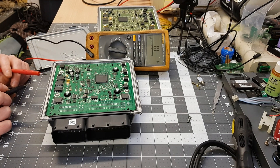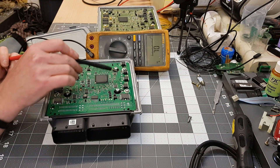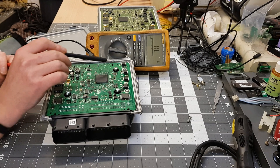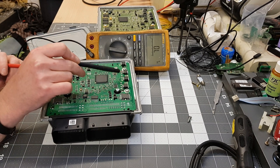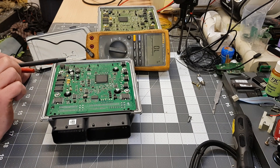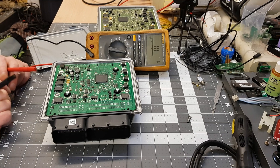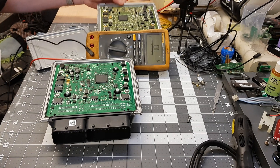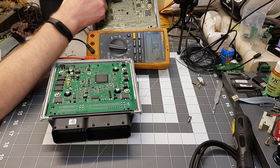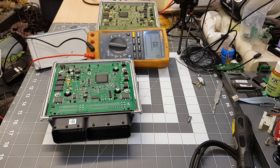So you can't find the fault through the diode test with the MSD81 drivers. The issue is most likely somewhere further down the line - not the driver chips themselves, but whatever is controlling them. That's the next thing to investigate. So there you go: MSD80 - always check these drivers, replaceable if needed. MSD81 - unfortunately a different issue happens with those.